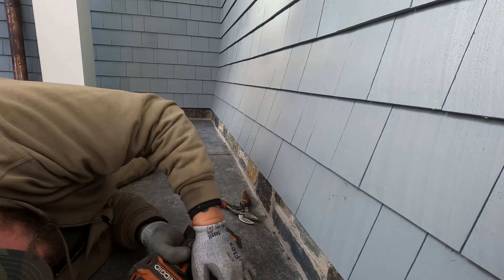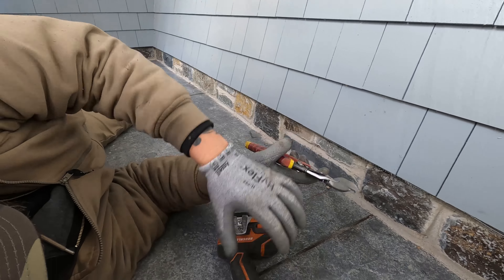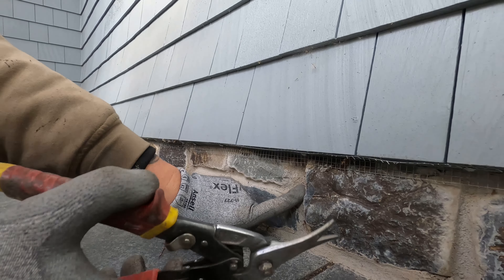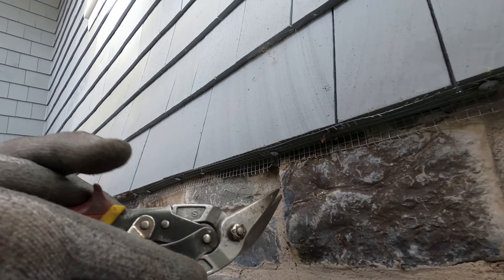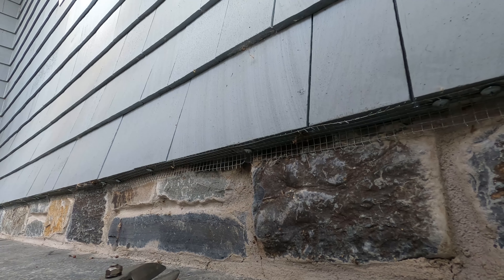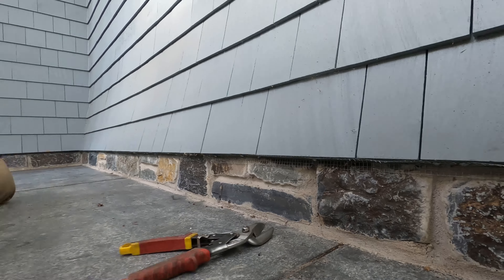Getting across this mesh here, we're going to make some custom cuts into the mortar joints to create relief cuts. We're going to want to add some screws so the mesh doesn't roll over on itself, and we'll put a little bit of pressure to it.